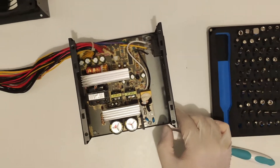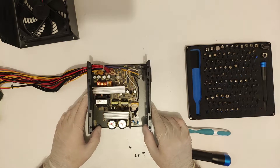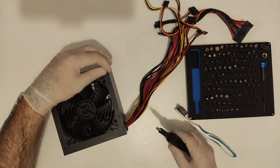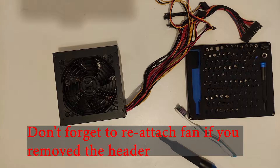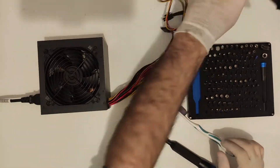At this point, it's a good idea to blow away the dust with a can of compressed air. You really shouldn't be touching anything anyway — just have a good look around, make sure that none of the capacitors have a dome on them and there aren't any funny smells like burnt plastic. Putting them back together is just a matter of fastening the four screws, but it can be a bit fiddly. Take your time so as not to yank out the fan header.